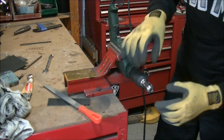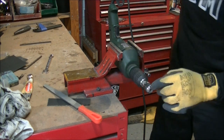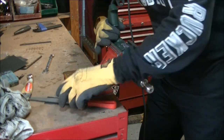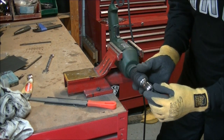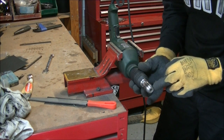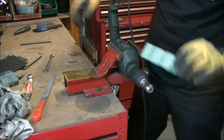Very, very light pressure — just check round to make sure you've got all the little nicks out. The action is to follow the contours; you don't re-profile it, you just want to follow the contours themselves. Now we've got little file marks or lines in that — although they're nice and circular, they're still not very attractive — so we've got to take the file marks out now with the 400 grit paper, so we move down to that.